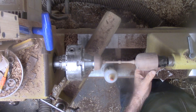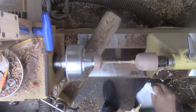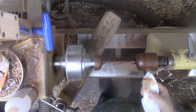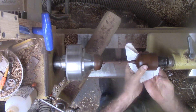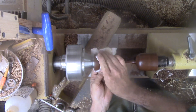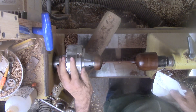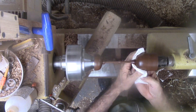After sanding the goblet, I can apply shellac and rub it in. The walnut is pretty and I like how this goblet is turning out. This goblet is larger than last week's goblet — both were from dry wood. I like this process since I do not have to fuss with the foot when the rest of the goblet is complete. The only risk is the band clamp but that is manageable. I also think goblets are more successful when I use a steady rest.